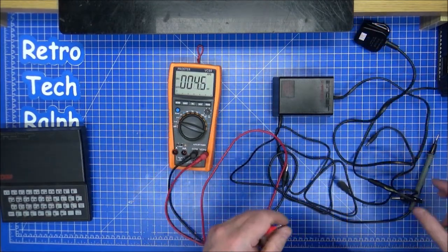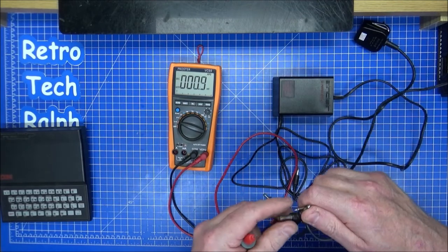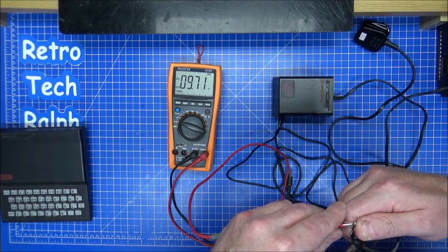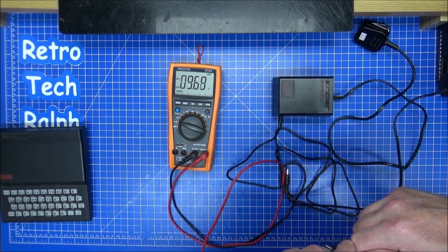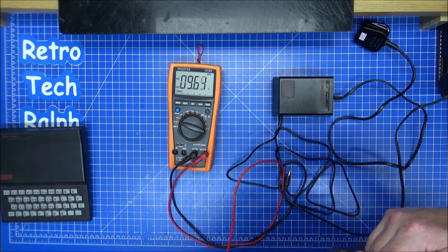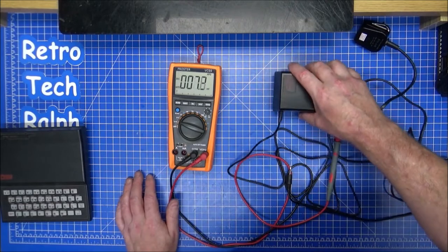Now I have another old-fashioned one of these with a power supply that I might consider using. I set it to 9. There's actually variable sections on the back of it, but I'm going to try. See, that's 9.332 volts. That's within regulation. I think I made that drop then. So 9.65, 9.7, that was me, on the black section. So 9.6 volts is easily explainable with a regulator that should be inside there. 16, I don't know.